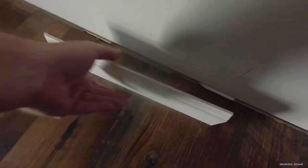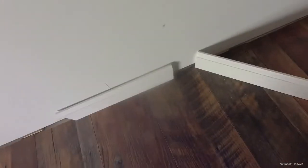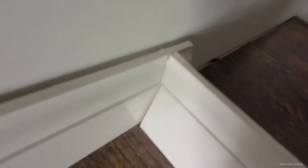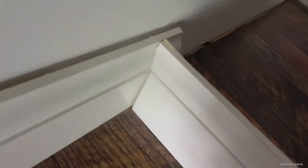But most houses that are done, they put the sheetrock up horizontally. When you get down close to the floor, you have a bevel on the bottom of the sheetrock — it's just slight. This is half-inch sheetrock. If you put it up against the bevel on the bottom, you'll see there's a big gap up at the top. So when you put the floor trim on, the floor trim lays in at an angle. Whether you're doing a cope or a miter, no matter how straight your cope is, you wind up with a gap at the bottom. This is just a junk piece that I made a cope out of — it's not a very good cope, but you can see it doesn't line up because of that bevel on the bottom of the sheetrock.